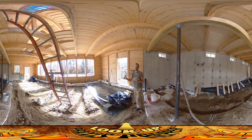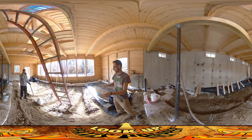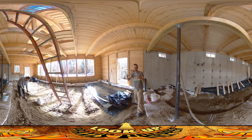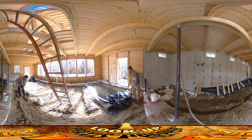Hey everybody, this is Praxis and today Josh and I are both in the lowest level of the house working on these air vents that are going to go underneath the slab. Josh has been working to get these paths in just the right place and packed down to be just the right depth. It all needs to be fairly precise because the bricks really want to line up together — and that's what I'm laying down right here. There's a bunch of cinder block brick. You can see there are two runs of it, laid on their side so the air can pass right through these two little columns here.